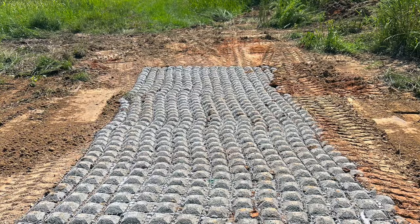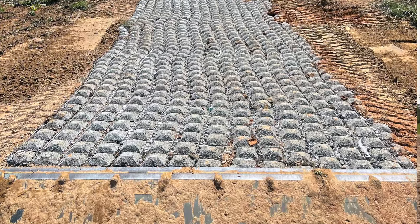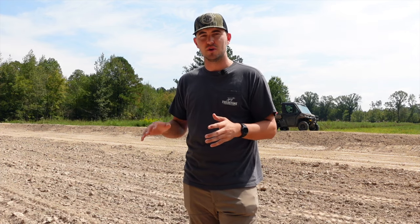We're going to come back and put the culvert in with the water gate. And for this year, we're not going to let that be the only out route for water. We bought a concrete mat, and I'll throw in a picture here so you guys can see it. If we have any overflowing water, we'll put in a low spillway along the dam on the southeast corner next to the water risers, and we'll throw in a concrete mat. That way we can still drive across that dam. So that's definitely going to help us out and not cause the problem that we had last year.